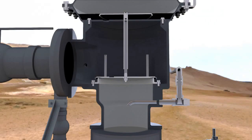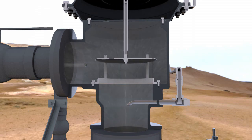In operations where pressure vapors must not be emitted into the atmosphere, Cashco offers pilot operated relief vents equipped with pipe away. At set point, the pilot discharge is relieved into the outlet header and the pipe away directs the emission vapors to a vapor recovery unit.